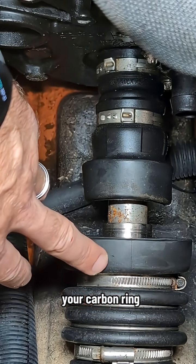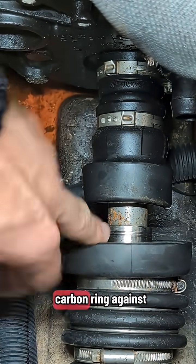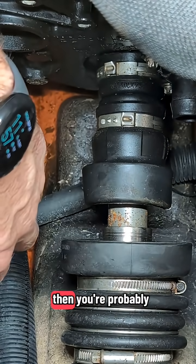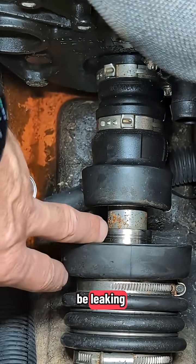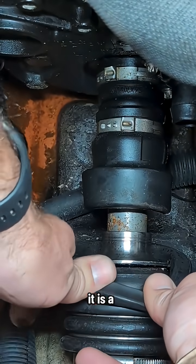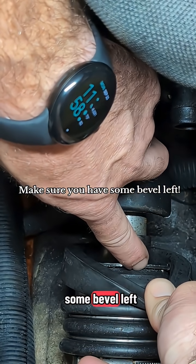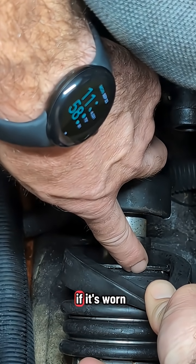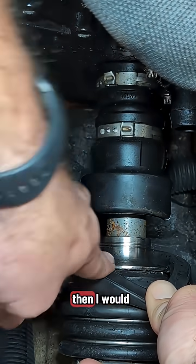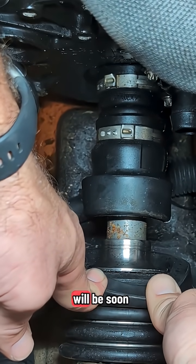Here's a quick way to check your carbon ring. First, make sure there's still pressure from the boot pressing the carbon ring against the hat. If it's all loose and sloppy, you're probably leaking or soon to be leaking. The other thing you can do is just slide this rubber boot back — it is a little tight — and look at the bevel right here. If you have some bevel left, you're probably good. If it's worn back to this flat spot right here, I would highly recommend changing it.